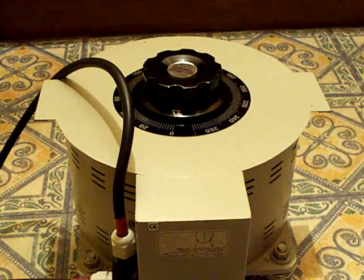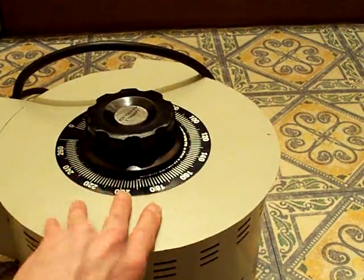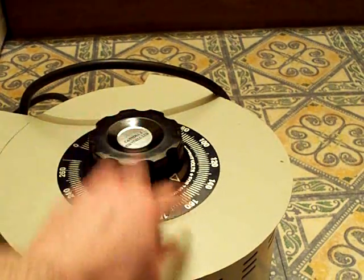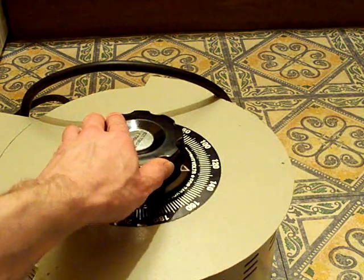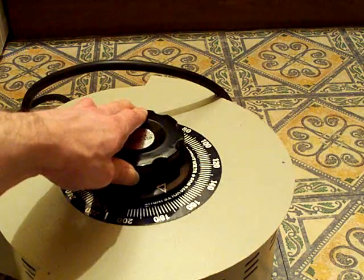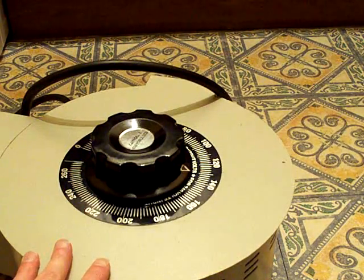What I want to do in this vid is have that casing off, and somewhere around the 140 volt mark — around about there — that's where I had it, and you can feel on there as the pickup track is a little bit lumpy. Yeah, something's not quite right in there. I don't know whether the brush is stuck in the holder or what it is. I was using that, and the smell coming out of it was really starting to sling up something proper.